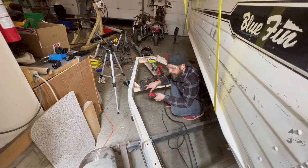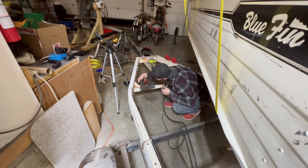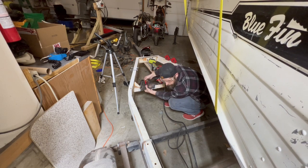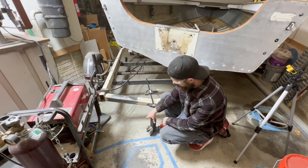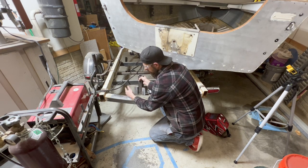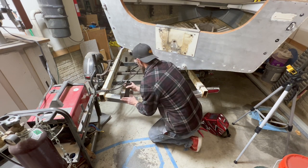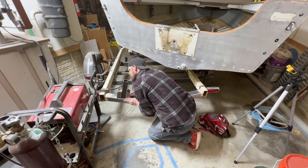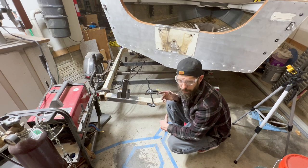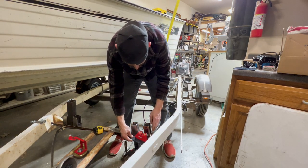Pulling the bolts out of the pillars and figuring out how to clamp them onto the rear frame section. Moving to the back of the trailer — we have our rear assembled riser and brackets. We're going to line up the laser with the front edge of the front bracket and use that as our reference point. If we do it from the correct side of the bracket, the laser isn't blocked, so that's our option. The challenge is clamping the laser device in place at the rear.